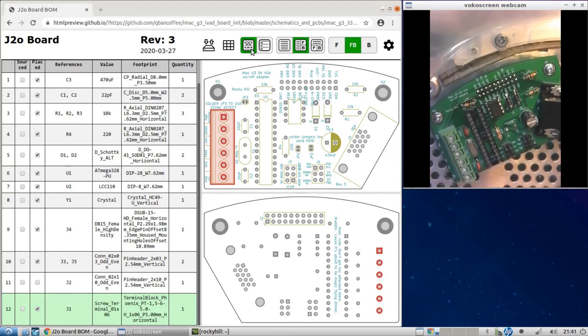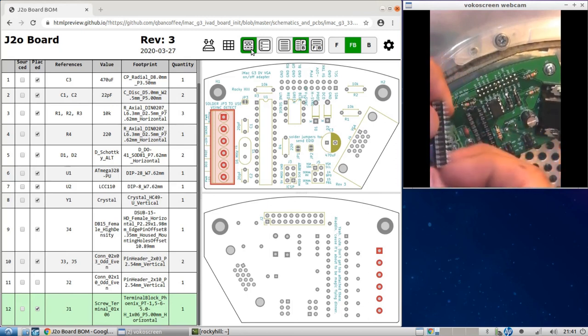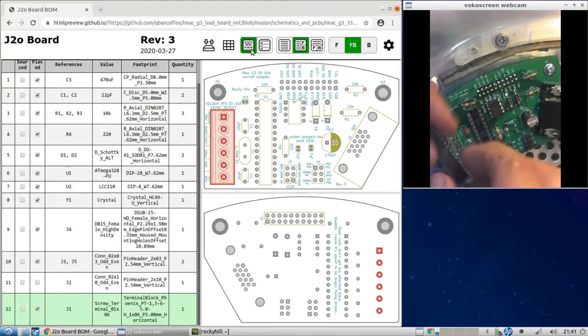Okay, that's soldered. Now, last but not least, is the actual microcontroller. So the microcontroller, just like the other chip, has a divot here. All right. And you'll see that, again, try to discharge yourself, touch ground or something, or if you have a grounding strap, use it. These pins are sensitive to static discharge.